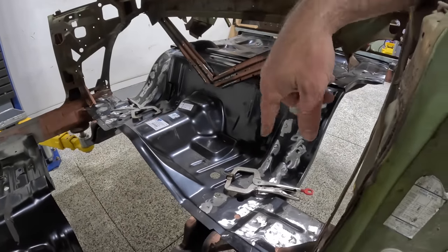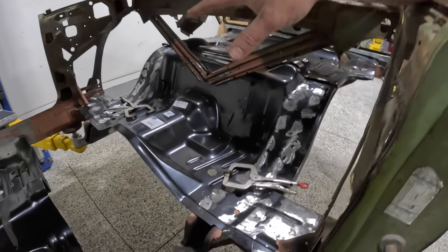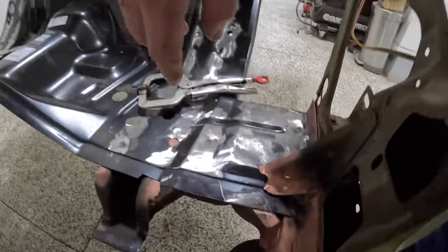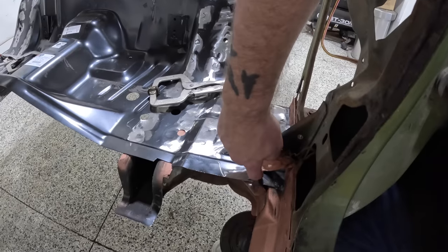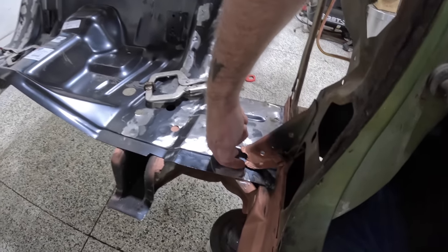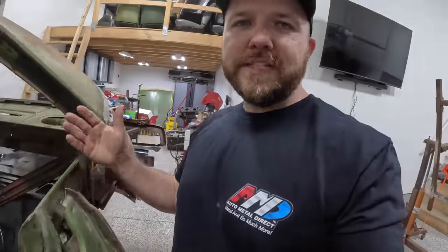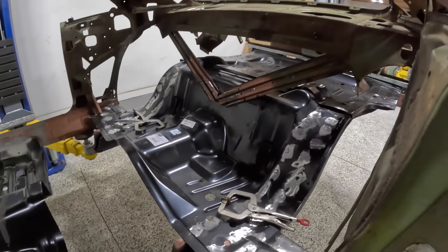Thankfully, all the supporting pieces from the frame rail to the inner rocker are in great shape. They cleaned up very, very nice. The only parts that I did not weld in are these brackets on both sides. The reason for that is that the rear footwell panel, which I'll be installing in the next video as well, actually slips up underneath of this brace and it gets welded down. So we're going to wait to do that until we have those panels in place. Really not a big deal.